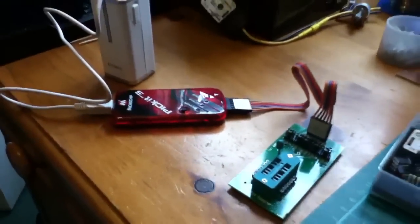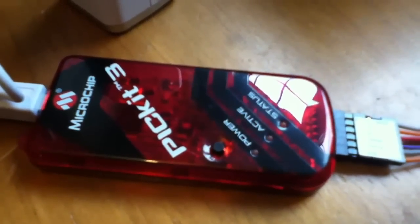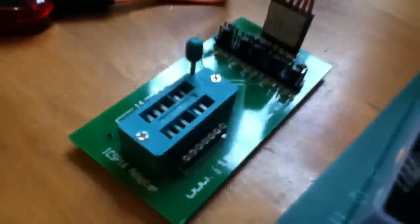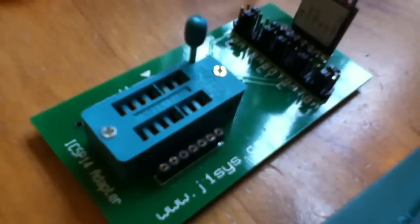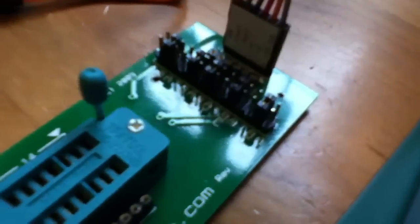This is the programming setup. I've got Microchip's PICkit 3 here, and that's in programmer-to-go mode. The hex code for the firmware for the chip is permanently stored inside this programmer, and I've stuck a sticker on the back — my product label — to remind me that this programmer is only to be used for programming these chips. It's connected via a ribbon cable to a ZIF socket, and this one is by J1Sys — you can see J1Sys.com. There are header links so it can be configured for different chips, and it's set up for the 12F683.